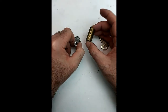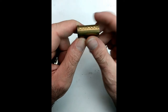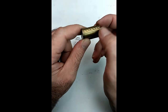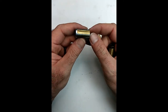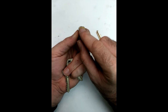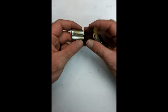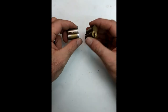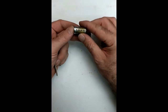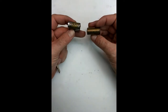What's different between a Falcon and a Best is that Best cores are typically held in with individual caps — it's not as convenient as you might think. I like Falcons because it's just a single slide that goes across the top, as opposed to these pins which take a fine touch to get in. With Best, all of these pins sit about a sixteenth of an inch down from the shear line, whereas with Falcon you just put the cap on, hit it with a hammer and it's on — and you can also pry it back off with a small flat head screwdriver from the back. They're made pretty much exactly the same; the control pin is on the same side. Interchangeable cores can come in six or seven pin, determined by the number of holes down the length — the more pins, the larger key system it can support.